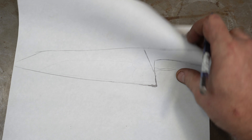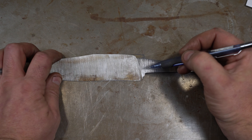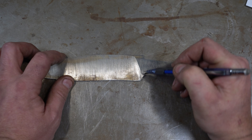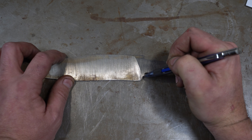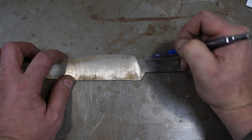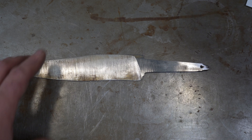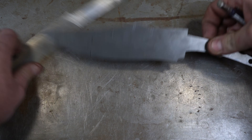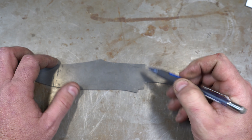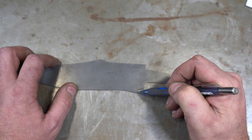The other type is a hidden tang knife that's going to have a guard. On most of my bowie knives I'll bring the plunge up into the ricasso so that this curve right here is sharp — the plunge ends up in that little curve. I'll make the plunge right about here so that this part is sharp, and it doesn't matter because the guard is going to protect your hand from that point.